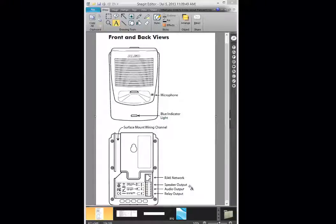One additional feature is that you can configure it to have talk-back. These can be small paging speakers within an office that can audibly alert and also have two-way talk-back. The nicest part is that they are SIP, so they register on the ShoreTel as a SIP extension and you can configure them to twin on somebody's extension. For example, if you had a shipping warehouse and wanted the night bell to ring at the same time as that person's phone, you could twin that person's extension as their additional phone so every time a call rang, it would also ring the night bell.